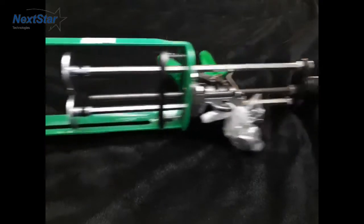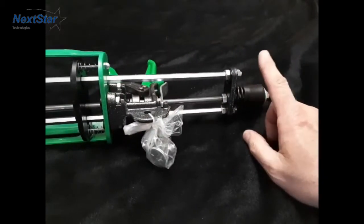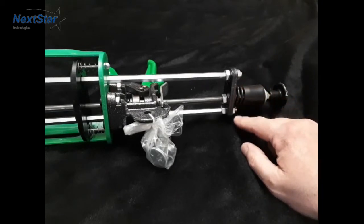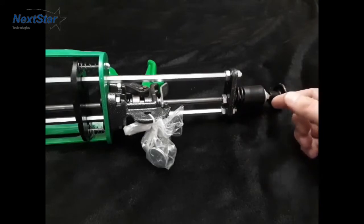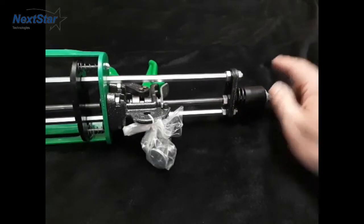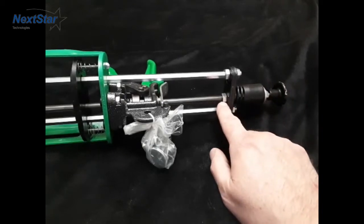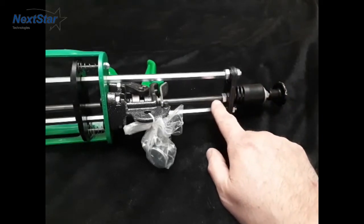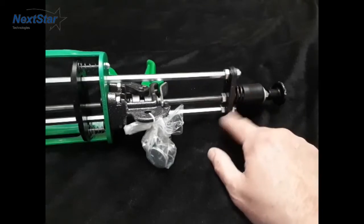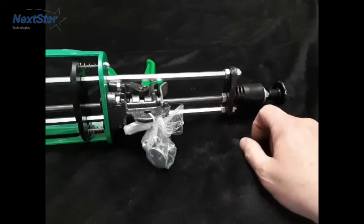This gun you can also get from us with a spring load. When you're doing, let's say 20 or 30 feet at a time, you'll find that by hand pumping it your arm might get sore, but it's more effective if you've got a spring loaded gun. This nut here will extend approximately a quarter of an inch, then it's at maximum pressure. That way the spring pressure is doing the injection. The minute it touches the plate, you can pump it back up to pressure.